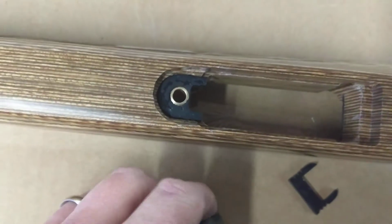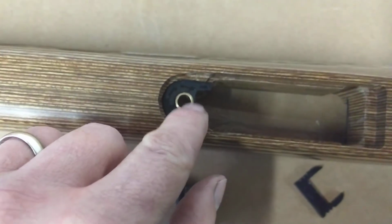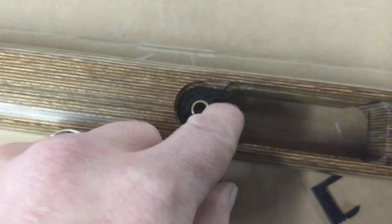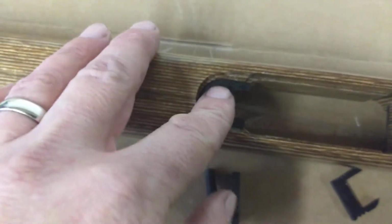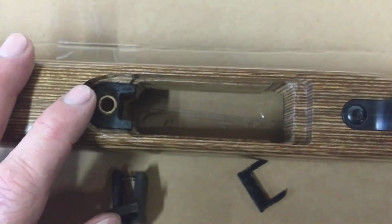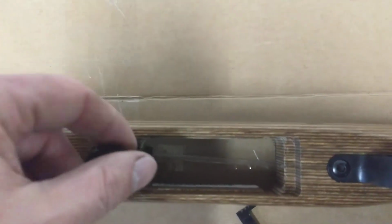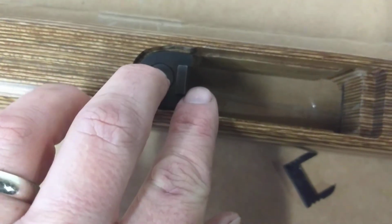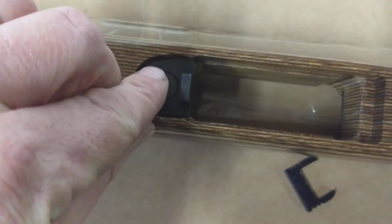And then you clearance it like this one's done for the swing latch to actuate, to grab the magazine and release it. And guys don't seem to have any real problem cutting that plastic bit on their factory Savage stocks, and given this part comes out and it's plastic, you shouldn't have any real problem cutting it. So that's my plan for the kit. You'll modify this piece, you'll just stack this mag catch on top of it. Again, the one for specifically this Boyd stock will share footprints with that plastic bit, so you don't have to cut out the stock area and modify any of that.